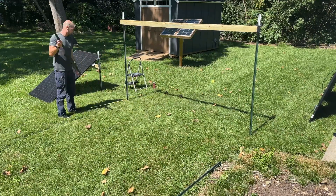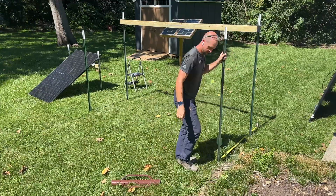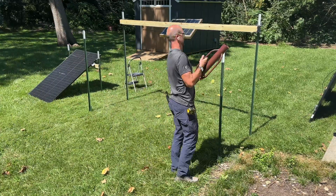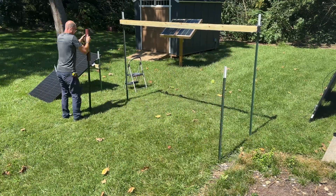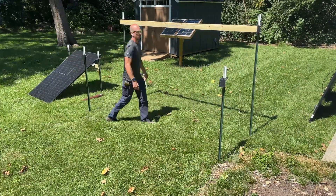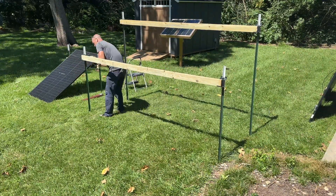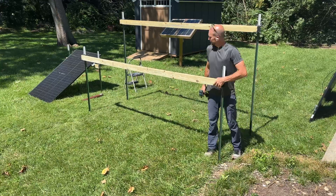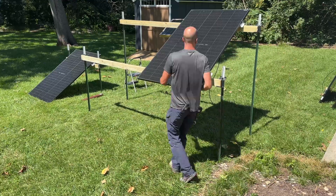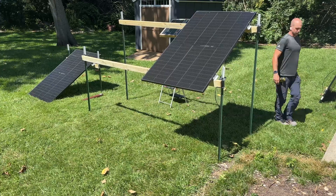I'll drive a screw in each side and then space these front T-posts 40 inches in front to get a similar 30-degree angle matching the one on the ground. Just checking the diagonals there to make sure everything is a rectangle and I'm not skewed in one direction or the other. Drive these two home, get those brackets on, get your board in place, and do the same securing with a screw on each side. Checking with a straight edge to confirm a 30-degree angle, then drive home a screw on each of the corners of the brackets holding the panel in place.